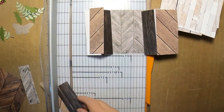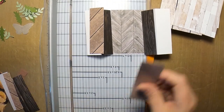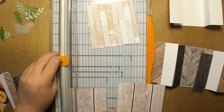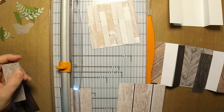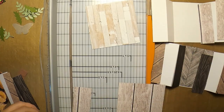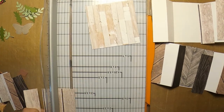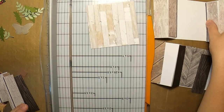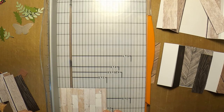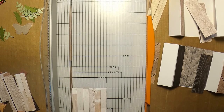Everything will have a nice finish. I'm bringing it in just shy of one quarter and they're four inches tall. I ended up cutting the side panels at just under one and a quarter — two of those — so they continue, since I had two of these four by four pieces. I used the smaller planks for the center and ended up having to trim it down. There I have my edges done, and it's right around three inches, but it really needs to be two and seven eighths so that it folds correctly. Trim it off and there we go — so now all of that will fit. This is why we dry fit things, right ladies?